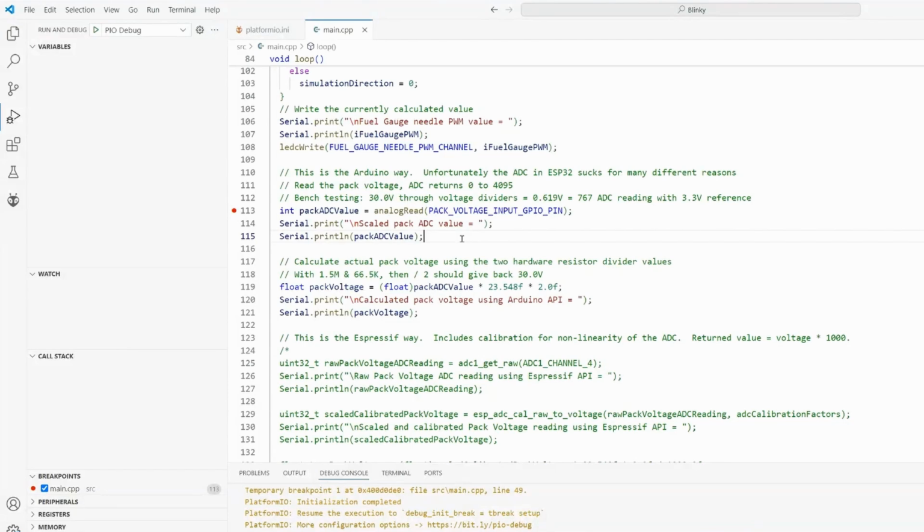So that's one part. The second part is the 4095 top value isn't even exactly what you should expect when you have 3.3 volts on your input pin. It could be internally scaling it to 3.3 volts, or I've read in other places 3.6 volts, 3.9 volts, whatever the 3.3 volt power supply on your circuit board happens to be, which could be, who knows, 3.4, 3.35. It could drift with time, meaning you can't actually calibrate at once.